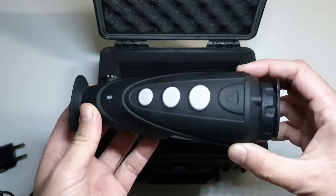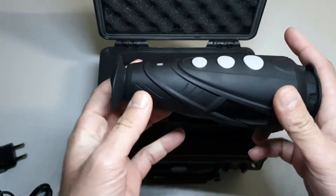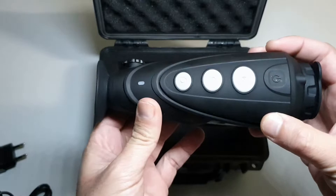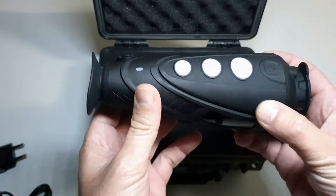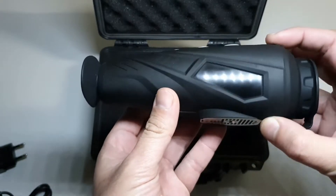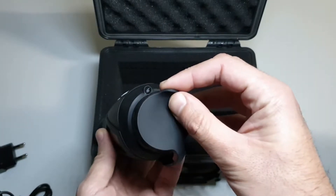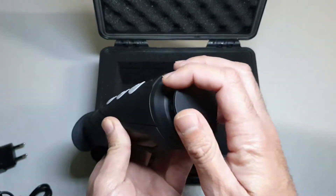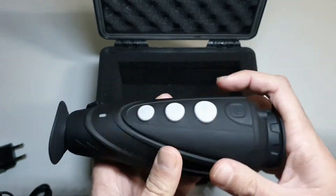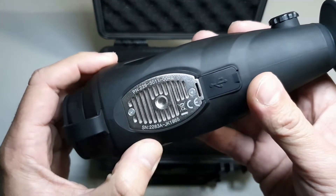It's an Infiray E3 Plus — a handheld thermal imager. The 25mm thermal lens is protected by a rubberized lens cap and overall it's quite a nice feeling device. It's got a rubberized finish, it's very durable and should withstand small drops. The E3 Plus has 16 gigs of built-in memory for thermal image and video recordings. It's got a 384 by 288 pixel thermal resolution with a 25mm objective lens and a 50Hz frame rate. There's manual focus adjustment which helps tremendously for long distance shots, and eye piece adjustment which helps get the clearest image for different eye conditions.